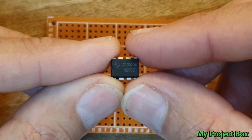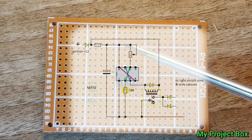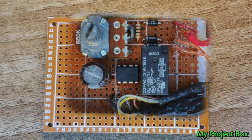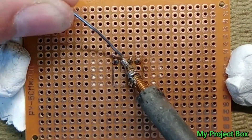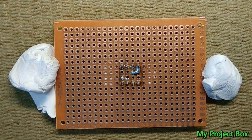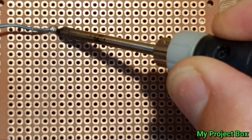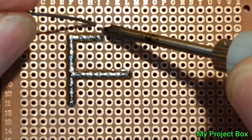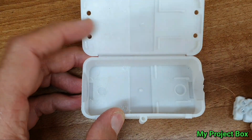I started by taking the 555 timer and placing it in the center of a piece of perfboard — a prototyping board. The idea was to lay the components out almost exactly the same way as my circuit diagram, since there are no space constraints, keeping it nice and simple. While soldering in the 555 chip I started linking the pins that were bridged together by blobbing solder onto the pads. On perfboard you can create your own tracks just by blotching solder onto the pads — a very cool prototyping technique that saves you from having to etch your own board.